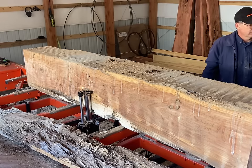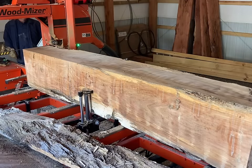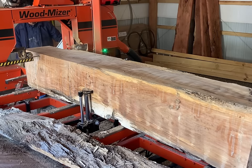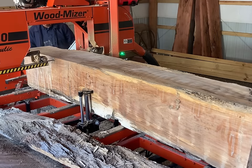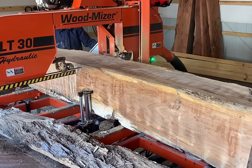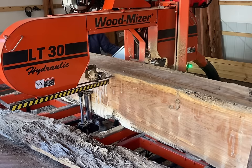I'm pretty sure the face that is looking at the camera right there is what I would consider the best face on the log. As you can see, there's a couple of small knots on it, and before we saw down very far we'll get into that large knot on the side. We are perpendicular to the stress crack. We're going to go ahead and saw one more fletch cut off of this to get down where we're in more of the heartwood and get rid of some more of this sapwood, which most of it is either rotten, gone, or doughy. Just bear with the slow cutting because this blade is getting fairly dull.